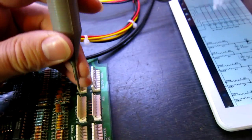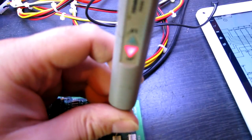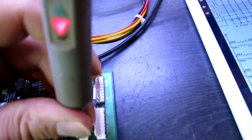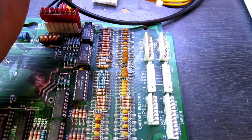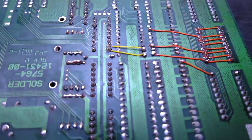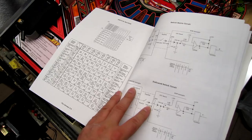Checking both of the drive connectors, we've now got pulses on all but the first two which are static. We've got a break around here somewhere on those two. A couple more wire links later and we're another step closer to fixing the damage.